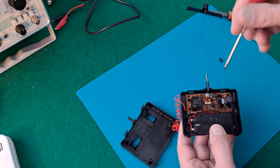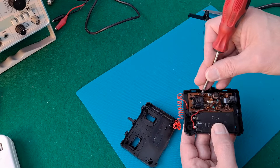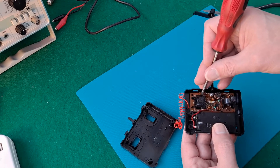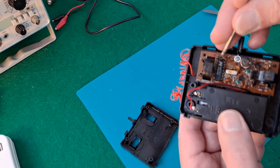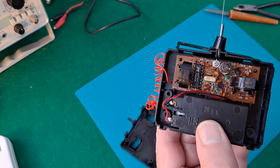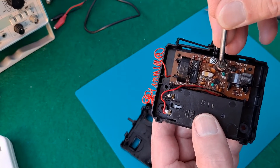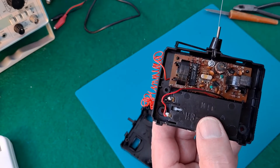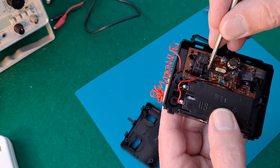The feed to the antenna is actually off a different pin — I can't remember whether it's pin one or one on the opposite side — but what it does is come out of the chip, then go through all of that circuitry to be converted to a signal to go out on the antenna. So coming out on pin 12, which is to do with the oscillator, it won't even have the signal on it.